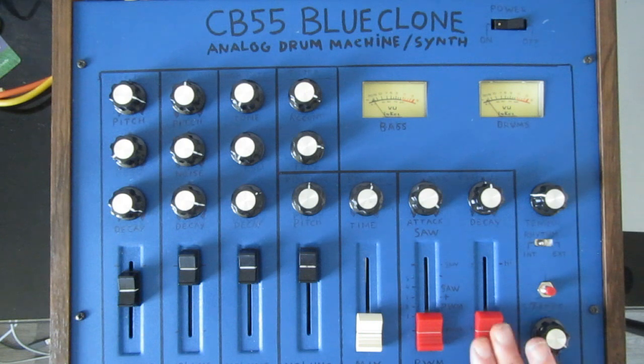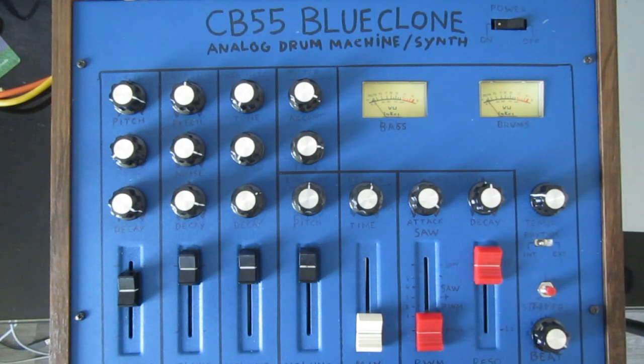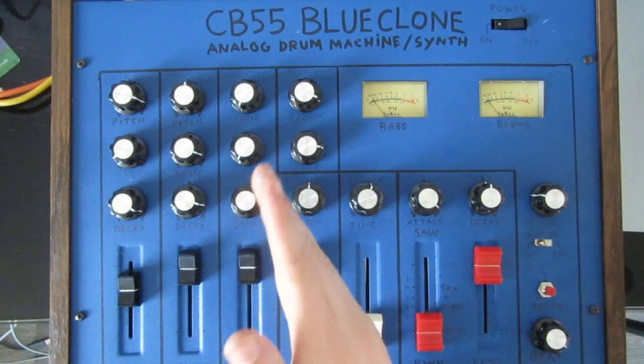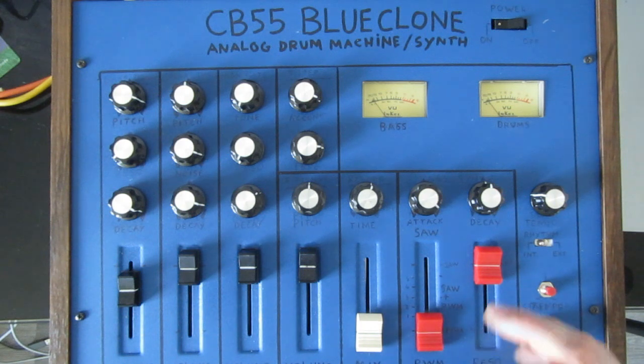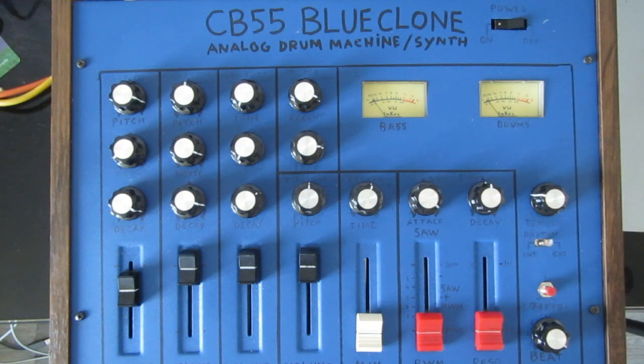Lastly, we have the resonance control right here — that's the resonance of the filter, from zero resonance all the way up to maximum resonance. The filter isn't self-oscillating; it's actually a bit of an oddity. It's a twin-T filter, which are usually used for kick drums. In fact, Drumeek, my other drum machine creation, uses a twin-T resonant circuit to generate a decaying sine wave for the kick drum. But in this instance I turned it into a low-pass filter. Because it already has natural resonance, it didn't need any extra components — it's actually a very simple but quite effective filter. A bit of an experiment, a bit of a dare, but I'm quite happy with the sound, so it worked out alright.